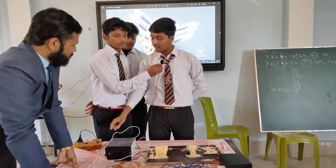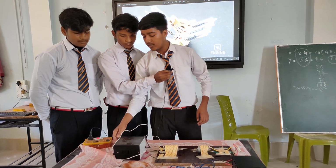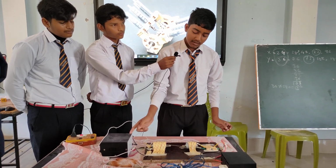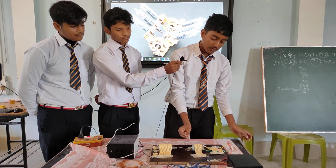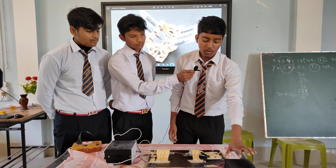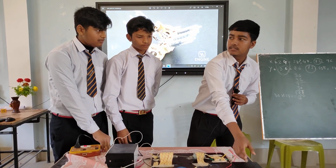So first we connect to the main current here. Then we connect to this battery eliminator. Battery eliminator is 2 to 12 volt. It gives what we need, we can use here. Then we connect it to a DC motor that Sanivas already told, 12 to 24 volt motor, and it gives current to this motor, and the studs will rotate, and for rotating, the current is produced in this motor, and from this 6 to 12 volt motor the current passes through this wire to a converter. This converter converts 12 volt to 220 volt, and we connect an LED bulb to show the current physically. And now Minas will say about the things that are going on inside this converter.